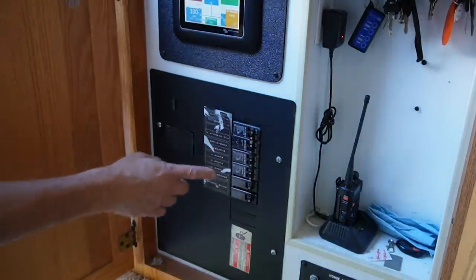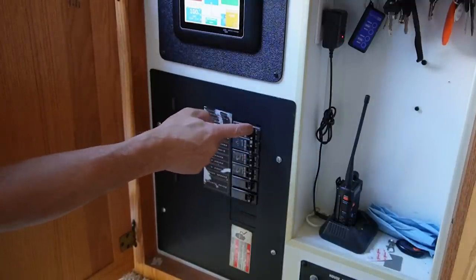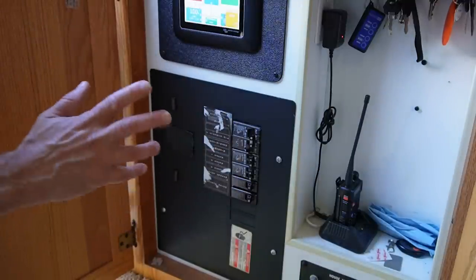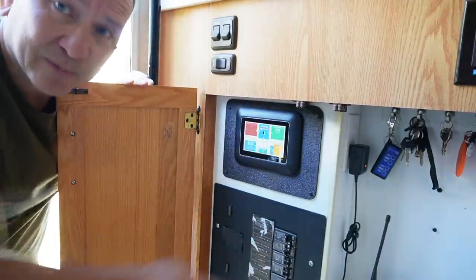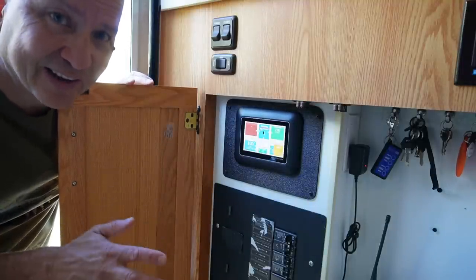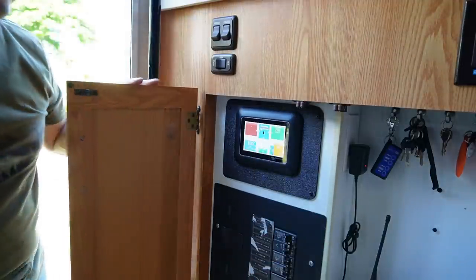All right, now my system runs off of two 120 volt AC circuits, one for each compressor. So this is the primary one, I'm gonna shut that off, and this is the secondary one, I'm gonna shut that off. So those are two separate 20 amp breakers. And that should totally disconnect power from the AC unit in the back. When we're out, normally I don't use the second one anyway. And this is a good point to make at this time because I don't think I need both of these 13.5K BTU compressors to adequately cool our motorhome. So anyway, just food for thought. Turn these suckers off.